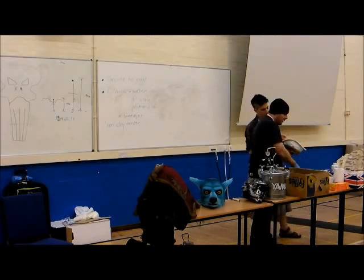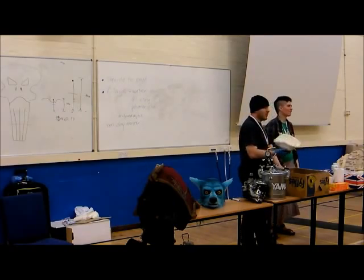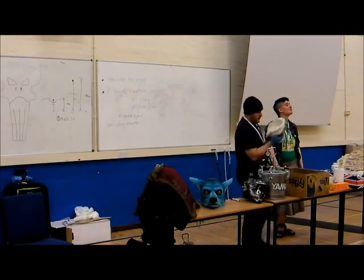That's cool. You'll find that as you build up the layers, if you're doing it nice and quick, because the mould gets warm because the resin's warm, it actually makes each layer snap a little bit faster. So yeah, firm.